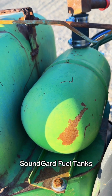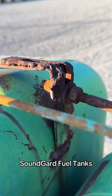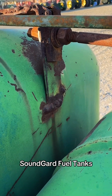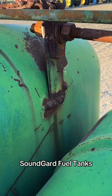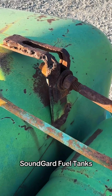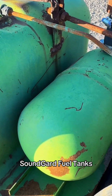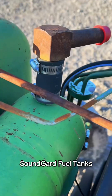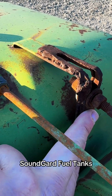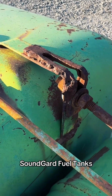So the only difference between almost all of the small frame tanks is an example like this, which you see someone has either repaired this or they added to it. All the newer style tanks or the 55 series would have every piece on it. But when you go back to 50 and then you go back to 40, then all of a sudden you start losing some of those pieces. So if you don't have this bracket and you need it, well, then you take it off your old one and you just weld it on here. So those are things you got to be willing to do.